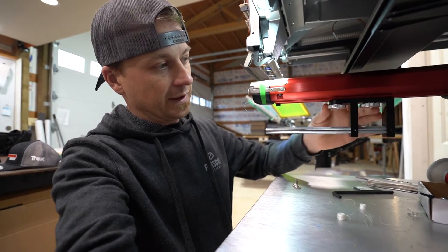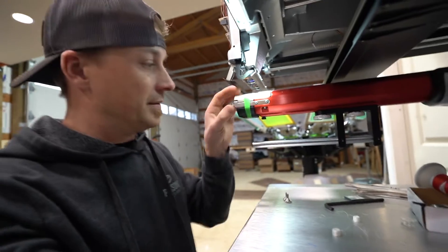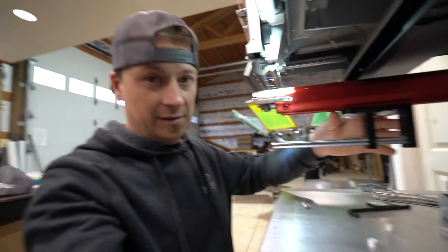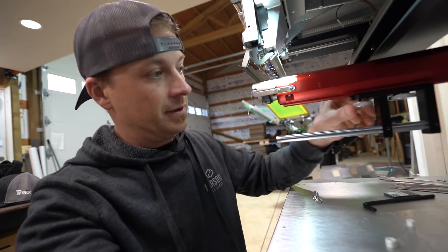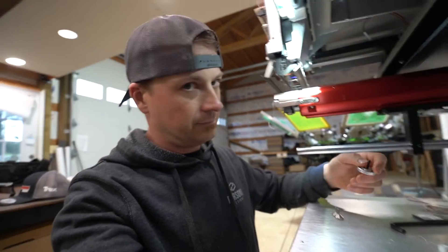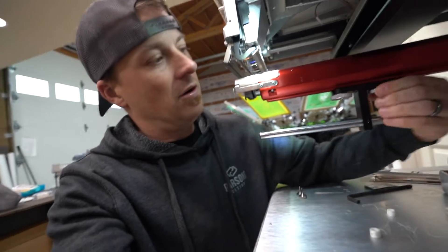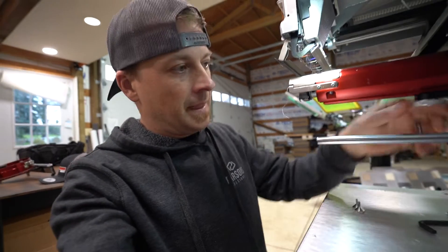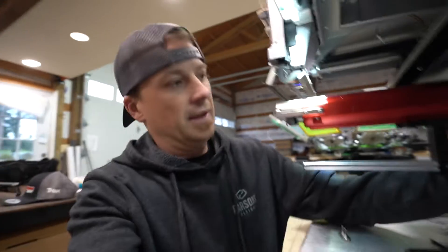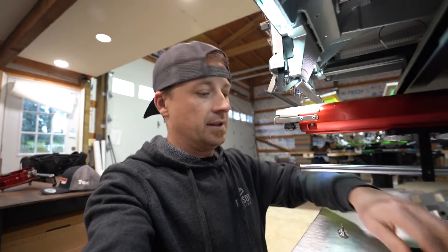If you don't already have your hat driver assembly on the bottom of the sewing arm, go ahead and slide that on by loosening these screws. You'll have to remove this part right here and slide it out of the way. Loosen these just a little bit — barely loose — and it will slide all the way back. I recommend, and I'll say this a couple of times: whatever machine you set this up on, label that hat driver and make sure it stays on that machine, because clearances may differ between machines.